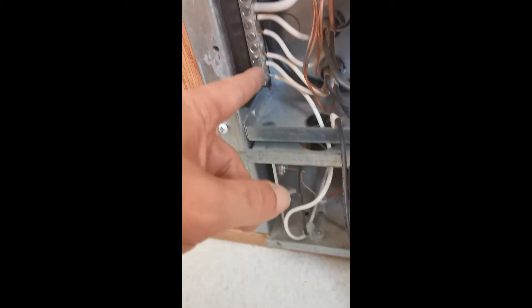What we need to do now is pull this breaker out — just pull down on it and it'll fall out — and we need to loosen off that bolt to loosen off the power feed for this unit, as you can see it's going down to feed the old unit. Then you've got this white wire you've got to disconnect, which is also coming up through here.